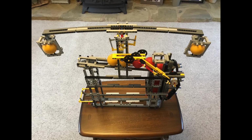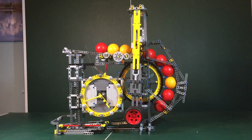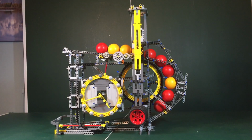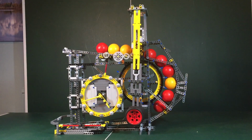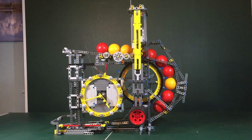I did start by making a lift or elevator style mechanism, as you can see in this photo. In this design, the balls fell slowly down the lift shaft and the track rotated a wheel to harvest the motion. The inherent friction of the lift mechanism under the weight of the multiple pool balls, however, meant it wasn't very efficient, and I soon moved on to the approach of the Ferris wheel. If you wrap the track around the turntable, it will fit exactly, and you can use a spacing of 3 tracks between blockers to make a continuous loop. The balls fit into the narrower gap because the curved surface of the wheel turns out all the blocker pieces and makes more space. 15 balls can be wrapped around the full circumference of the resulting Ferris wheel.